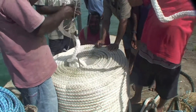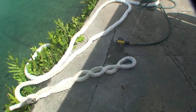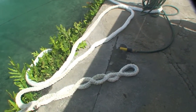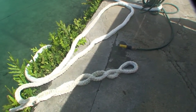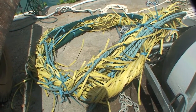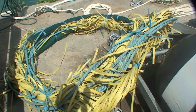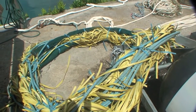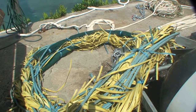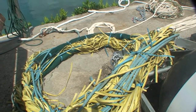We're now about to unravel this and put another splice in this end as well. Now we've got the rope spliced up both ends. This is the rope that goes to the weights — the floating rope. We've just put a splice in that — 40 metres of our FAD. This is a rope-covered cable. This has all our plastic strapping and a type of fly-wire material. Once we let this all unravel and float out, this is the reef-type structure that we hope will hold the fish there.